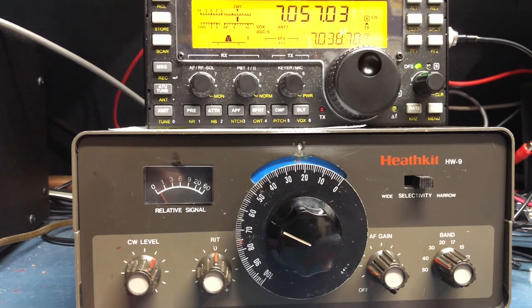It works with all bands, with two caveats. On 80 meters it seems to be about 3 kHz higher — I don't know why, but that's an easy adjustment. On 12 meters you need to add 750 kHz. My only other option was the local oscillator, but then I would not have had 12 meters or 10 meters at all.